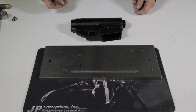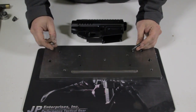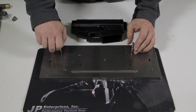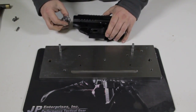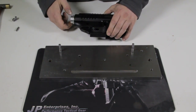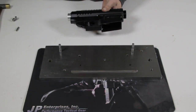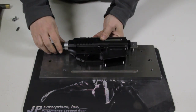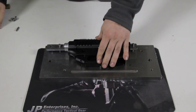The presentation grade finish process begins with one of our billet receiver sets — in this case, a CTR-02. Before coming to us, all of our receivers receive a hard coat anodize, which creates a layer of rock-hard aluminum oxide on the surface. This is the case even for rifles that go on to receive a colored finish like Cerakote. To make the hand polishing process more efficient, our first step is to use a precision surface grinder to remove this initial layer of aluminum oxide while also perfectly leveling these surfaces.